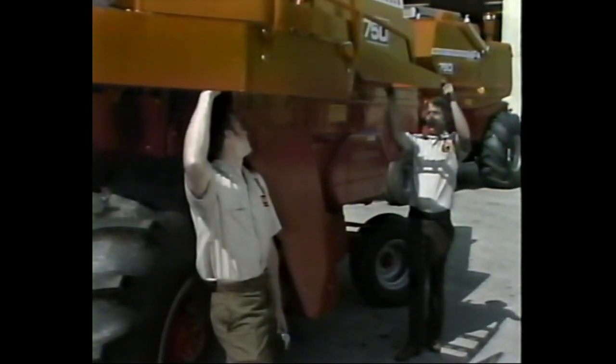Correct spring tension should not exceed a manual effort of 25 pounds when the ladder is raised to the locked position. Once the spring tension is properly set, raise the ladder until the lock pin on the latch assembly engages the V-block on the ladder rail. If the pin on the ladder does not engage the latch assembly, loosen the 4 bolts holding the assembly in place and slide the assembly in the slotted holes provided until the pin will engage.